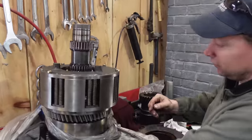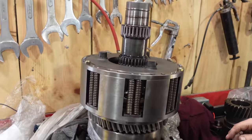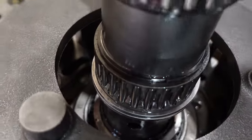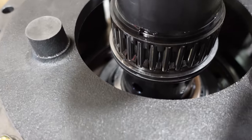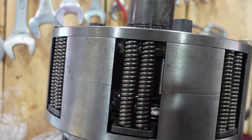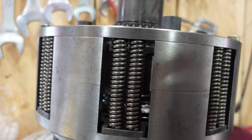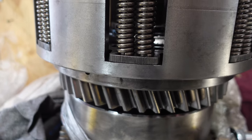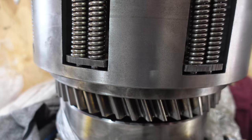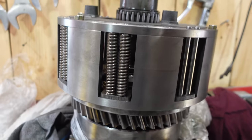Had an issue. It wasn't working. So I pulled the plate out. I put oil on there to see if we had any piston seal leak. But now it's the air in it. It is moving. So now we'll put everything back together and see what clearance we have. And then take it all apart, put the right plates in, put it all back together again.